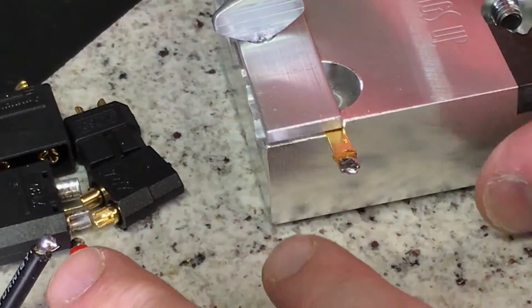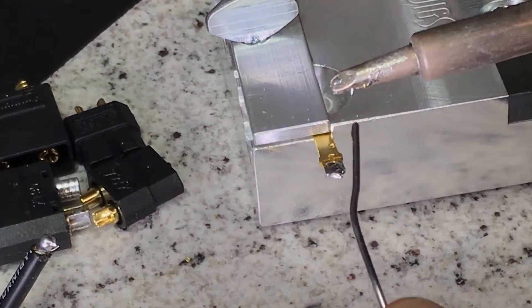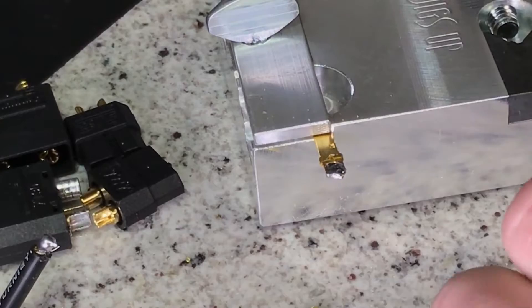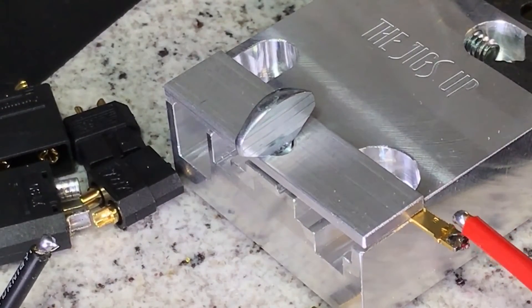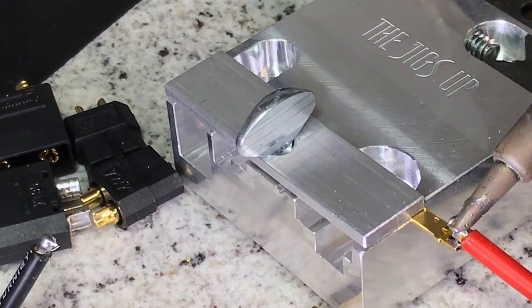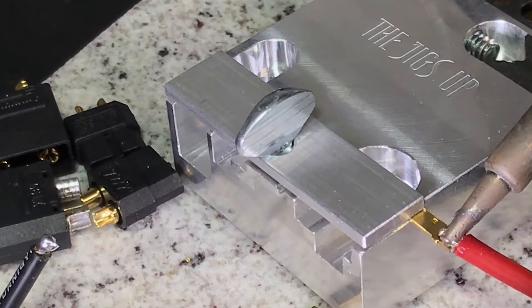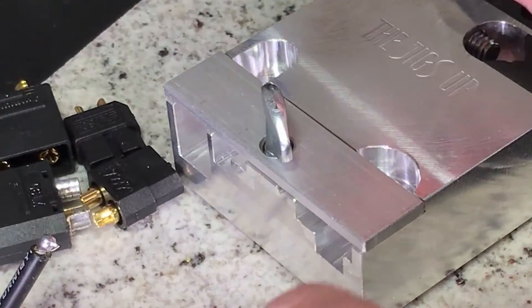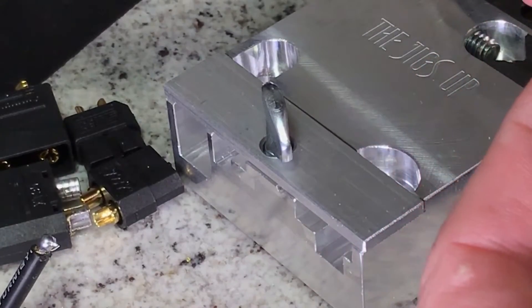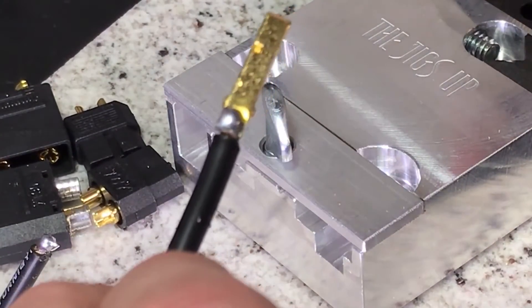We'll set this next one in the jig and just for practice: clean the soldering tip, tin it with solder, and solder the wire to the connector. Remember to heat the wire to melt the solder that was tinned on the connector and it will join. Hold it in place while it sets — you can do it a couple of times. These are a little easier to solder right off the bat versus those XT90s over there. If those XT90 leads get too hot, that housing will melt and you will just ruin your connector.